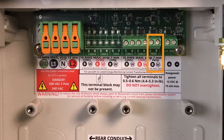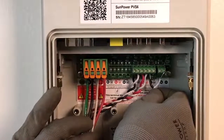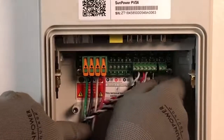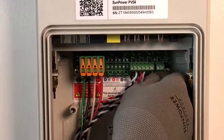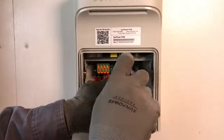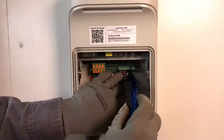Find the prod terminal in the PVS-6. The connections are clearly labeled on the sticker beneath the terminal. Connect the black CT lead to the black terminal post and the white CT lead to the white terminal post. Make sure that all strands of wire are in the terminal and that no wire insulation blocks the contact between the terminal and the bare wire. With your torque screwdriver, tighten the screws to within 4.4 to 5.3 inch pounds.